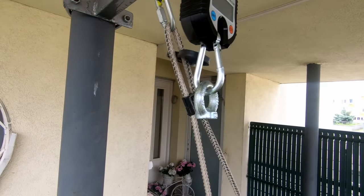My teachers always told me to calculate twice and measure once. Boy, they were right this time. So for example, for M10, I found on Simplify3D that the ultimate strength where the PLA will break is 65 megapascals. 65 megapascals, it is 65 newton per square millimeter. And if I calculate with the diameter of 8 millimeter, which is approximately M10 without the thread, the area is 8 squared multiplied by pi divided by 4, and from this I can calculate the force. And if I divide the force by g, I can get the maximal weight, theoretically. So 333 kilograms.